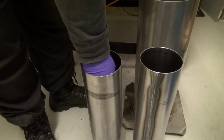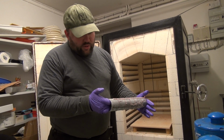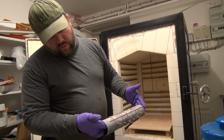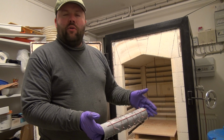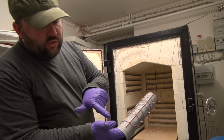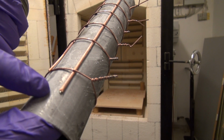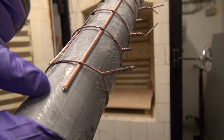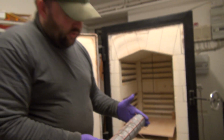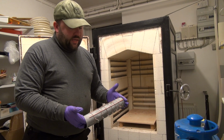The other two tubes we have here are basically similar to the ones we used earlier, with a ground copper tube with a rod of our preferred silver soldering material in the cavity. You can see right down at this little end, there is a tiny piece of the silver soldering material extending from this copper tube. One of these is going to be placed inside the gas chamber as well.